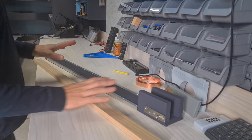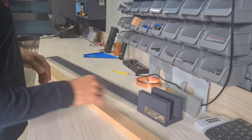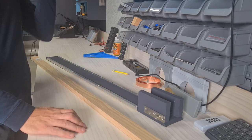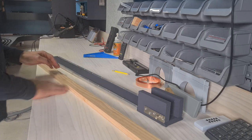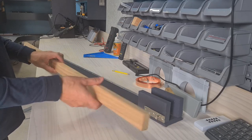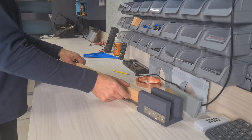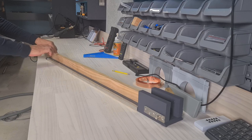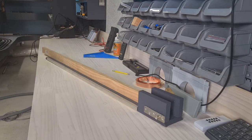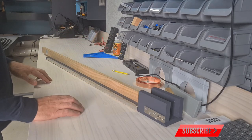I had a bit of a chance to think before I get this in place, because once it's glued and screwed into the joints, you're pretty much going to have to break it to take it back off. What I've done is gone back and painted up the areas — I thought it'd be easier painting them now rather than later. I'm also going to give it a little bit more strength in the main spine by taking a piece of pine, 42mm by 19mm, putting it right down the center with a 45-degree cut angle at the end to make it neat, and gluing and screwing it in place. That'll give it a nice strong backbone.